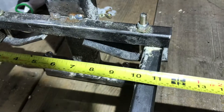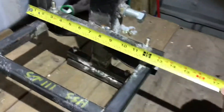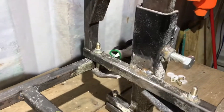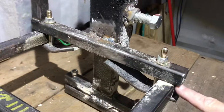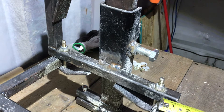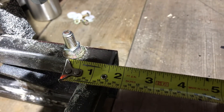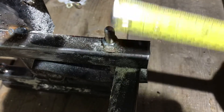This overall width is 11 and a bit under — should be about 11 and a half inches. The reason it ends up like that is all these holes on these parts: this section is a foot across, as you can see, and both pieces are a foot. I wanted a little step front and back — the same one-inch step everywhere. It's a one-inch tubing with the hole one and a half inches back to the center of the hole, using three-eighths bolts.